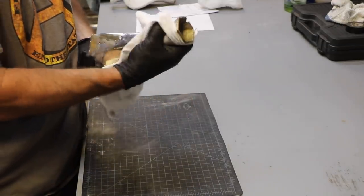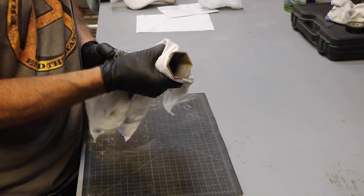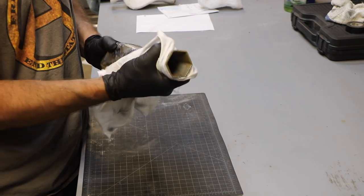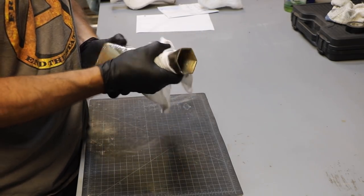So why did this thing crack so much? Since I didn't control the alloy, there's going to be areas in the vase that don't have a good mixture of copper and zinc, and obviously make a weaker, more brittle alloy. So there's weak spots in the metal.